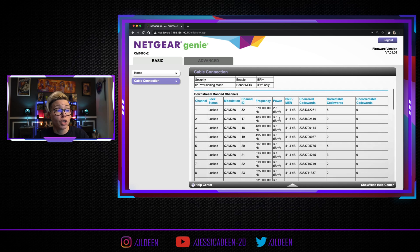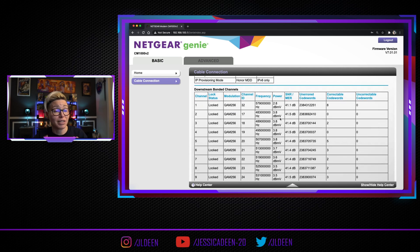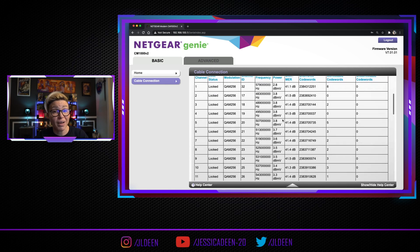For power, best practice is somewhere between negative 7 and positive 7 dB. If you're seeing values lower than negative 7 — like negative 8, negative 9, negative 10 — you're going to want to contact your cable company to find out why. Before you do that, I'll give you one tip to help you check it yourself. But out-of-range power is one indicator of what could be causing reliability issues with your connection to the cable modem.